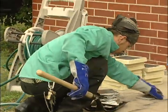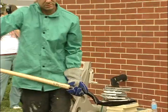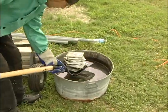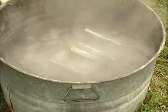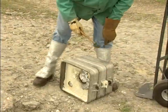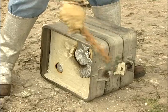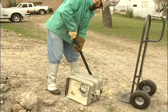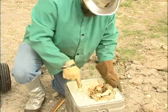Here's one of my students doing that very same task. Here I am shaking out the pattern from the mold material. The resin sand mold is a very, very hard mold material. Once the aluminum comes in contact with that sand mold, it becomes even harder. And so you literally have to carve out the casting.